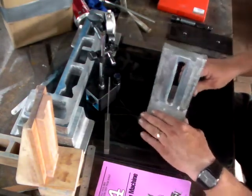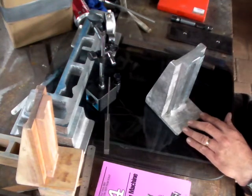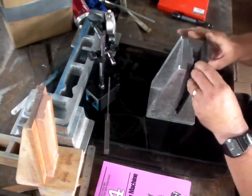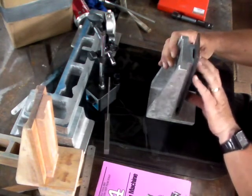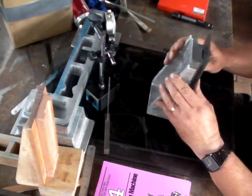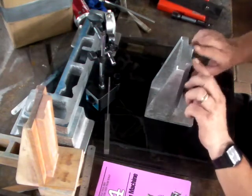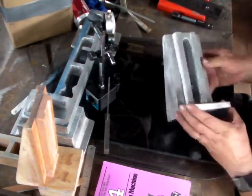Once I was able to get that surface correct, my next surfaces are these two ways. They have to sit on the bed — the metal ways will eventually screw to that with eight screws. So this face here has to be parallel with the bed, not tipping backwards and forwards or being on a slight angle. I needed to get this face square at all points of the compass with the bed.